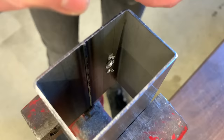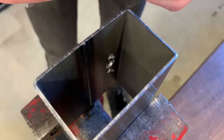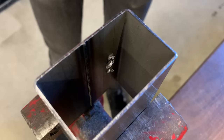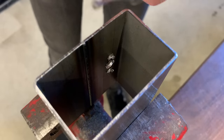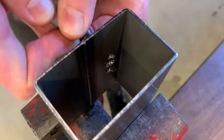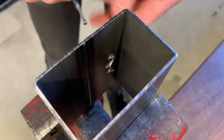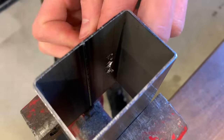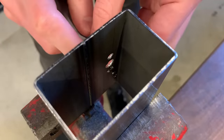The outer two holes are drilled approximately 5 millimeters or 3/16" of an inch, regardless of what size bolt you're using. We've just raised a bunch of burrs on the inside of the tube, so when I put the nut in there it's not going to want to sit flat. This is fairly easy to deal with near the end of the tube using a deburring tool, but as you can imagine, this would be a lot harder to deal with if you couldn't see the inside — I'll show you one way to deal with that later.